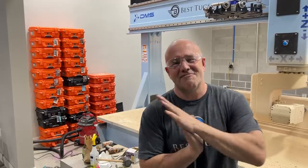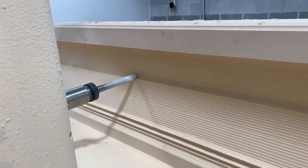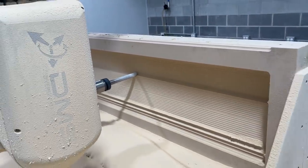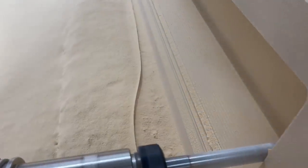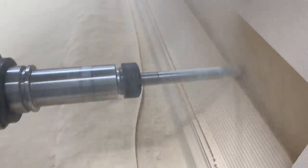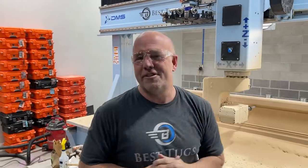Random fact: we're spinning this at 20,000 RPM, we have a three-flute ball end mill, and it's traveling at 300 inches per minute. So if you do the quick math, every single inch on every single pass has 200 cuts. I don't know why anyone would want to know that, but when you're watching a machine run, you do dumb things.